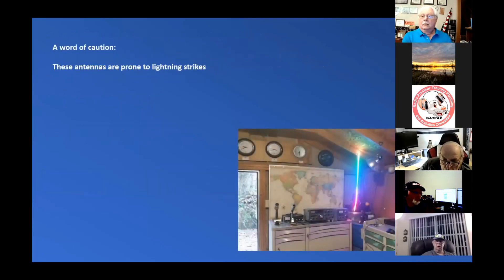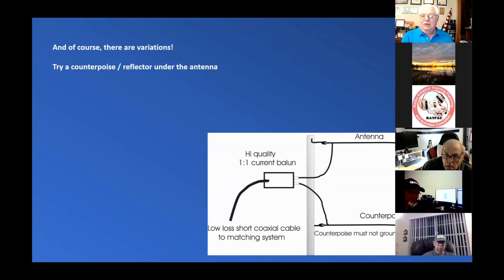Those numbers are for the total length of the wire. One thing you need to be aware of is that if you get into weather like Clem's, long wires are prone to lightning strikes. Some of the diagrams actually show a counterpoise underneath the mounting system — just like a vertical, they're putting radials down around where it mounts to the ground. Running wire under the antenna can help, building a reflector that sends more RF straight up and avoids dissipating it into the ground.